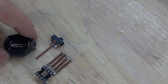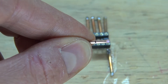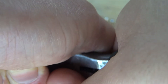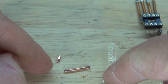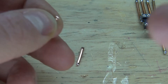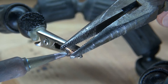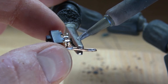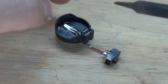As you can see, the wire is a little bit too long. I need to make a mark right here — this is where I need to cut. Now I have a little piece of the wire, and I'll shorten the other wire. I'll take this little piece of wire and place it on top of the other wire. Soldering the two pieces together will allow me to solder to the slide switch. Then solder to the center pin of the slide switch, and take the other end of the wire and solder to the positive terminal of the 3-volt button-cell battery holder.